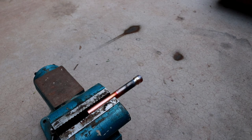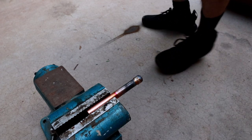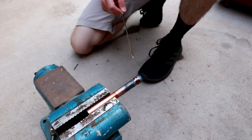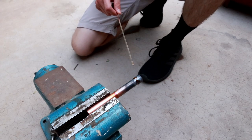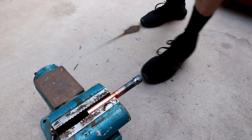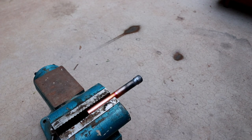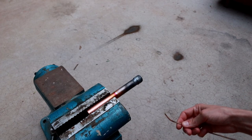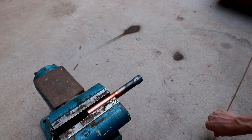I'm going to go around and inspect to see if the braze made it all the way around. Unfortunately it did not. So it may require that I actually rotate the pipe in situ to make this work, unless maybe I can come up with a clever way to wrap the braze rod around. I'm going to try applying a bend to the rod to see if I can get at it from the other side.